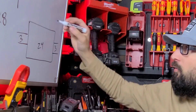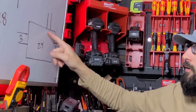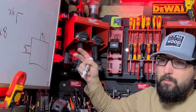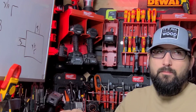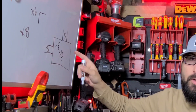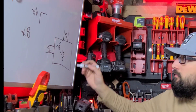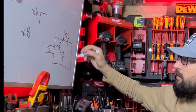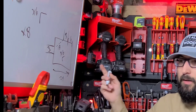What happens if we're coming out of the top of this box and we need to enter closer to the middle? If a three-inch conduit came out of the top or bottom, the multiplier is six — so an 18 by 18 box is not going to cut it here. We have to make sure that these conduits are a minimum of 18 inches away from each entry. What really makes sense is if this box is more like 24 inches.